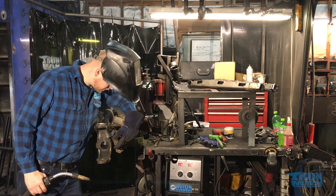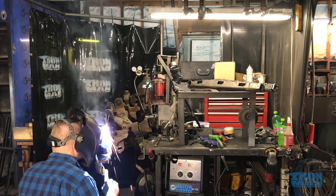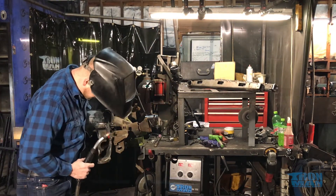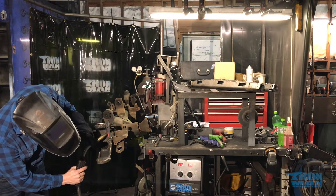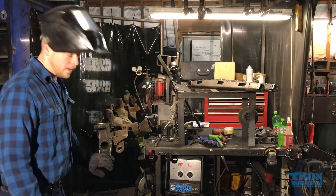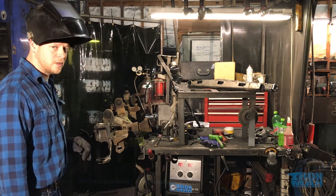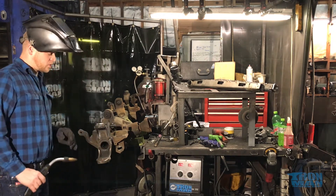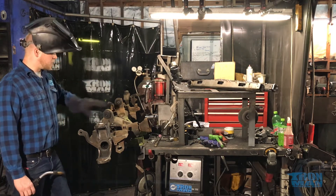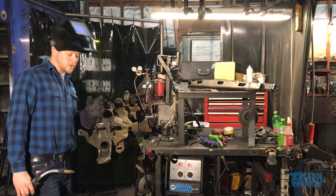That whole gap is filled in — we're totally filled in here, down the front. On the second weld, I brought the weld all the way out to the edge of this flange, so this entire piece in there — over an inch wide — is all welded. I've done this over and over again; I've never had any of these move or bend doing it this way. It's a really good way to keep these guys straight and keep your axle from bending right here. As far as bending between here and here, you can do a truss. The top trussing normally bends it when you weld it. The guys that really race will tell you that an under truss will keep it from bending, but you lose ground clearance — so that's up to you depending on how your build goes.